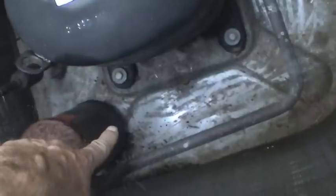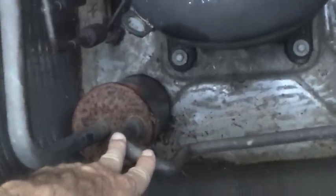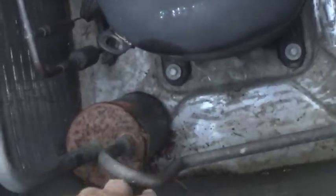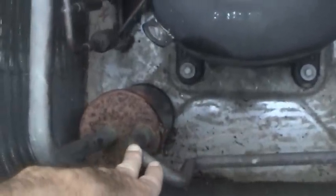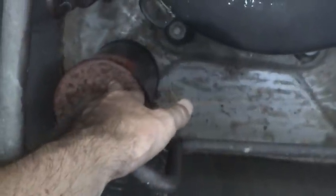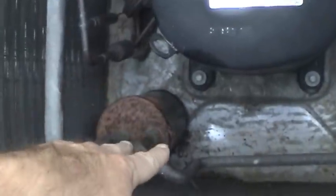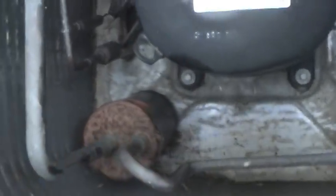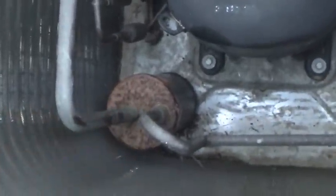There's not really much I can do with the bottom of this thing, so I'll just have to wait for that to go. I can maybe put a little bit of grease under there, but it's still wet from running last night, though the top is dry. I'm hoping that right here is the worst of it, because it's exposed to the sun and also to rain even when the unit's not running. Hopefully I'll get more life out of it, and if not, I'll unsweat these two joints, pop in a new accumulator, charge it back up, and be good to go. But I'm going to see if I can prolong that for a few more years and keep this running without risking burning out the compressor.